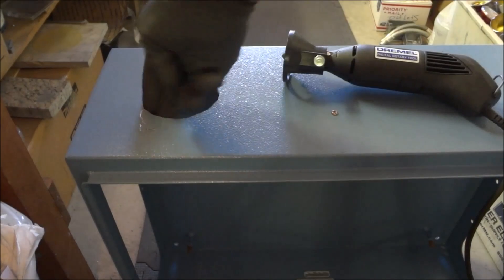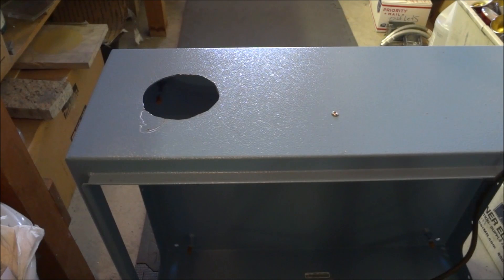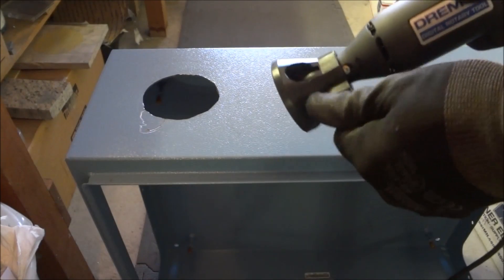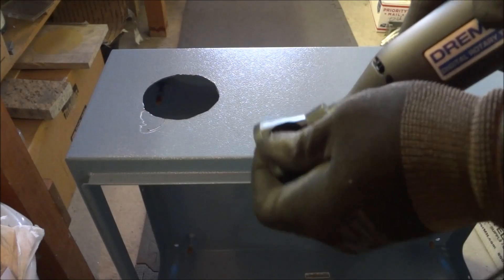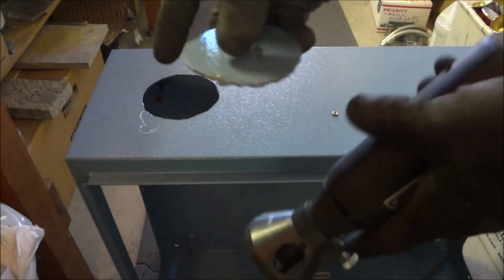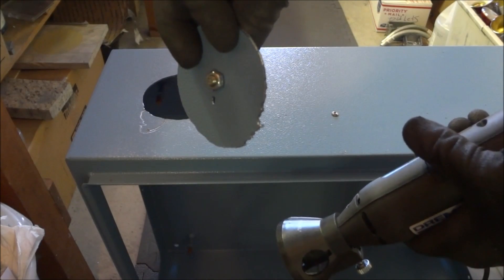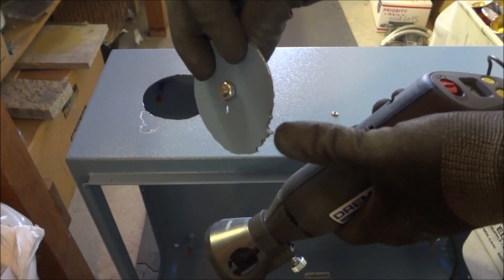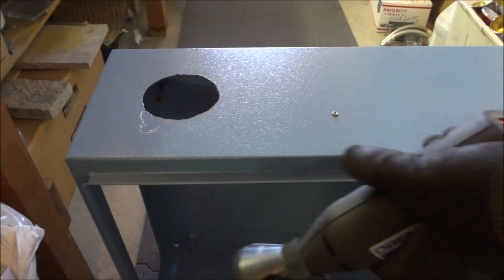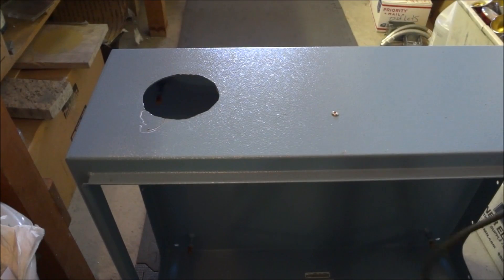I got the hole finished with my portable milling machine. I went back with a little grinding wheel and kind of cleaned it up. It didn't turn out as perfect as I thought — the little base on the Dremel got a little wobbly, it started to slide up on me, which caused my end mill to slide down. It got to where it was just on the shank and not the actual cutting bit, so it wasn't really cutting. It kind of caused it to lift up and veer off. But it worked — it's a little jagged, but not quite as clean as I had planned.